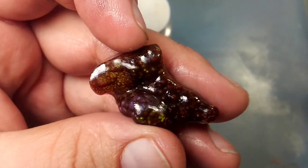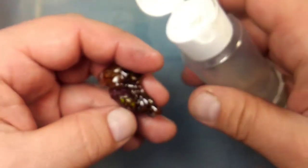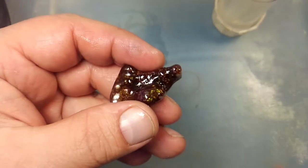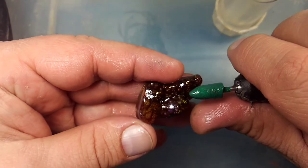So I'm just kind of roughing it out. Always use these wet — don't let them run dry. I use, especially in the coarse stages, a little bit of mineral oil because they get better adhesion to the stone and it's less likely to run dry.